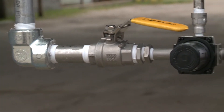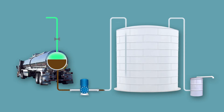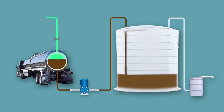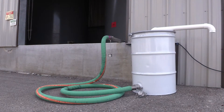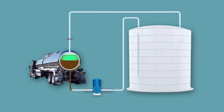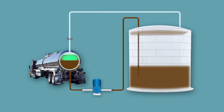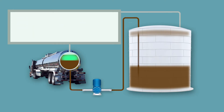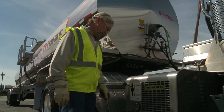Cargo tank trailers are usually unloaded with nitrogen or dry air pressure. An alternative method would be offloading using a pump while adding nitrogen or dry air to maintain a dry atmosphere inside the tank truck. When unloading with either of these methods, leading industry practice is that all discharge vapors be absorbed or scrubbed free of TDI. A closed-loop vapor exchange system using a product pump is another means for unloading TDI. Closed-loop means that no vapors escape from the system into the atmosphere and no moisture from the atmosphere enters the system. If dry air is used for unloading, it is extremely important to check for signs of moisture. Many companies recommend a dew point of negative 40 degrees Fahrenheit.